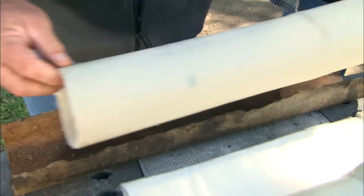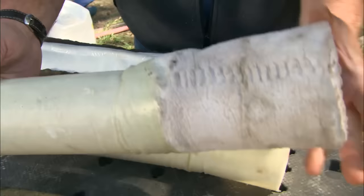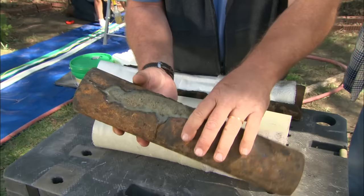What we're going to end up doing is taking your existing pipe under the slab and running a new pipe inside of it. How do we get a rigid pipe like that into our drain line? It doesn't start this way — it actually starts like this: a polyester sock that we're going to coat in two-part resin and stick inside the pipe. Over time it'll cure, and when it does, it'll change state from this flexible sock to this rigid pipe. With this system, we can take a pipe that's badly damaged and end up with a smooth, beautiful pipe on the inside.